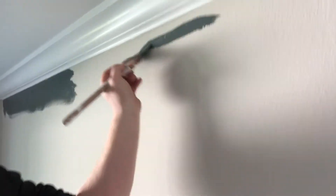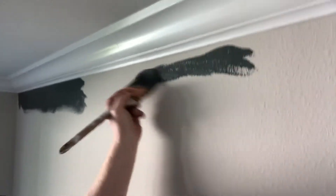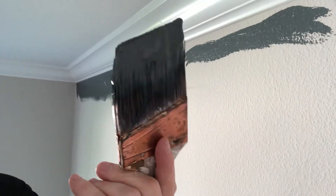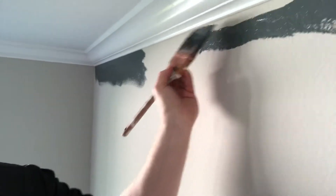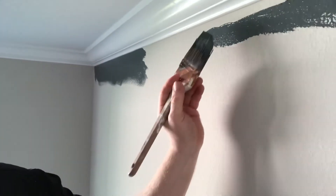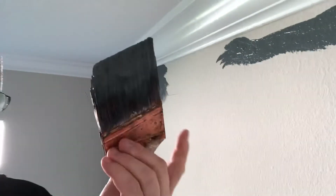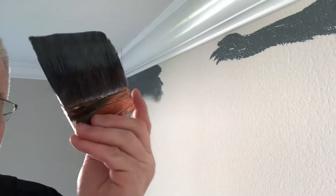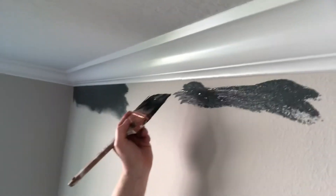With lots of paint, start down here and get the paint off of the brush. Invert the brush — look at the angle. You're going to turn it on its unnatural side, and instead of painting with the forward edge touching the ceiling, you're going to invert it and paint with the rear edge. Look how beautifully it comes out.